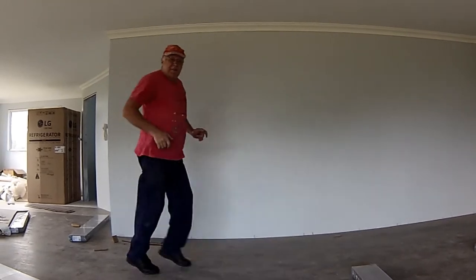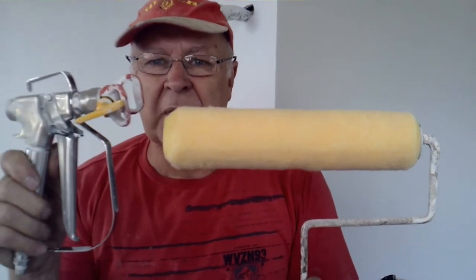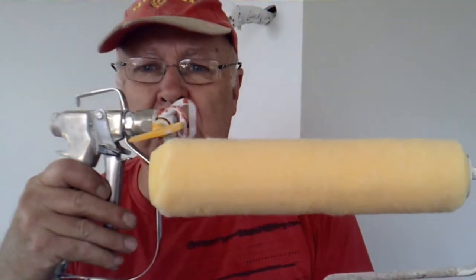I need to take a step backwards. In the previous video, I finished dealing with ceilings, but I got one more thing to add. I thought that I'd thrown my roller away for good because I was using the airless spray gun. But subsequently, in looking at the ceilings, I realised that in the large rooms particularly, where the angle of light is very narrow across a long space, I wasn't getting maybe as much coverage of minor faults as I would have hoped. And so I put on a coat of the same paint that I'd put on with the airless spray gun with a paint roller.